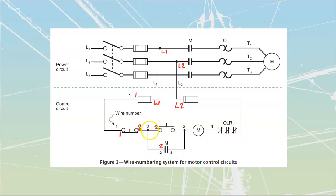We label this line until we've labeled every end of it. We don't make splices in control wiring — we go from terminal to terminal. You should be making all of your connections underneath terminals, not with a wire nut in the middle. Moving over now onto my next one: here's a three, three, and a three, and then we hit a device so we change numbers to four and four. Then on the other side we have five and five. Once we have got everything labeled, we can carry that over to my actual schematic.